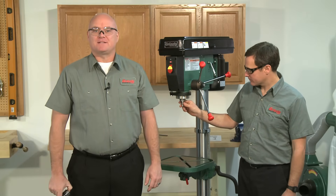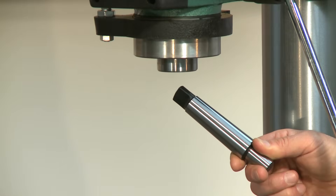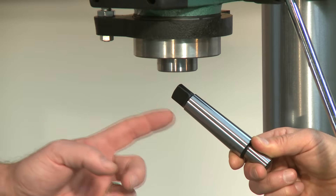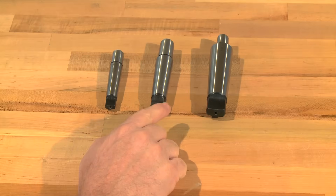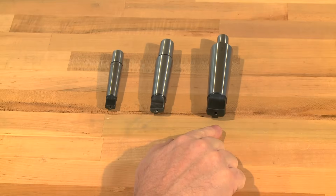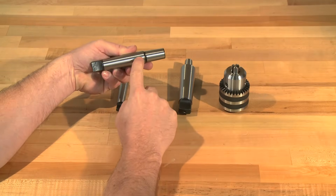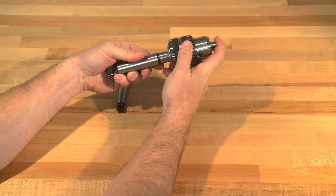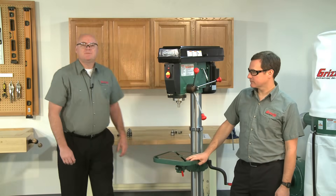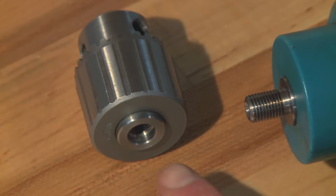Many of the medium and larger capacity drill presses have an internal taper on the spindle known as a Morse Taper or MT. They are also sized by number and range from 1 to 6. MT2 or 3 is the most common taper found on benchtop and floor model drill press spindles, but industrial drill presses will often be MT4 or sometimes larger. The drill chuck is connected by means of an arbor, which will usually have a Morse Taper on one end and a Jacobs Taper on the other. The shorter Jacobs Taper fits into the back of the chuck. There are some drill presses that have external threads sticking out of the spindle — for this, you only need to know the thread size and you can easily match up the chuck.